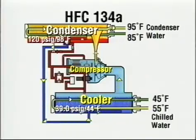Refrigerant pressures and associated saturation temperatures can vary widely based on the type of tubes in the heat exchanger, whether a brine or freshwater solution is used, the pass arrangement on the heat exchanger, and the water flow rate. These values are normally found on the chiller design data specification sheets. The pressures and temperatures shown in this example are typical for a chiller sold today, but variations do exist.